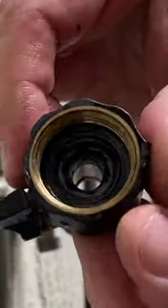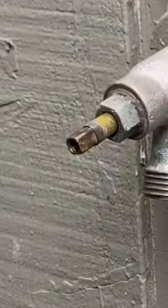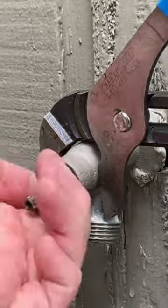To help stop the drip that they've had. Now we just got to try to get this handle off without breaking it. You want to use a backup and unscrew this packing nut here.